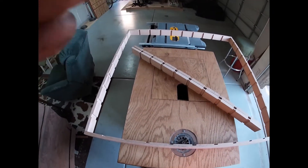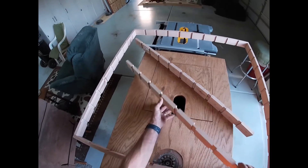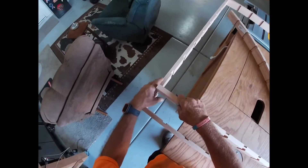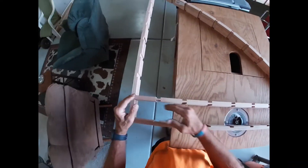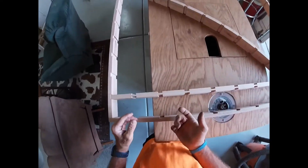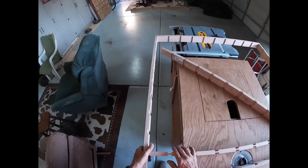At this point, we have our frame built. I've done all the chiseling and sanding I needed to. I still have a little more sanding to do on the shelf pieces — it's a little tight to fit into this groove, so I'll just put it on the sander and shave off just a hair. I've only got three shelves cut so far and still have to chisel and sand out the remaining grooves. I need to figure out how to assemble this because once pieces are vertical, I can't get my nail gun in.